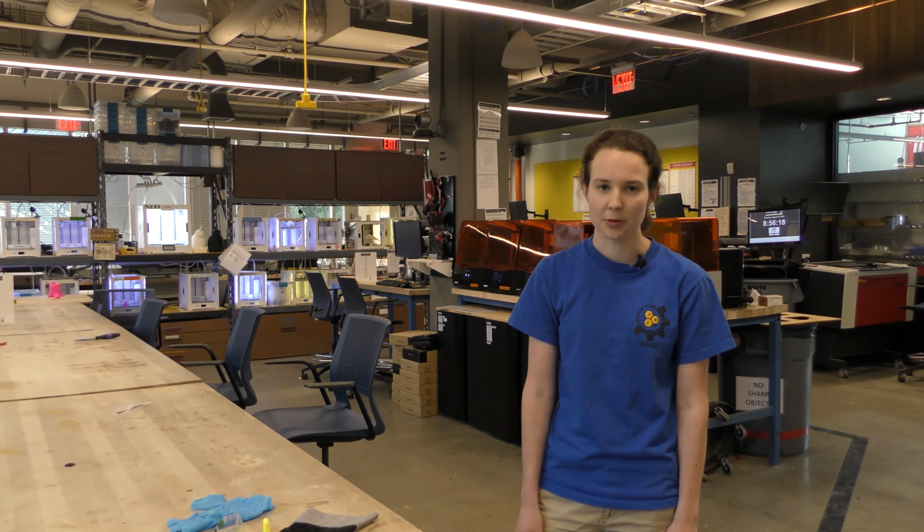My name is Claire, and in this video I'm going to talk about the safety section of the PI checklist. The first thing that it's important to know about when entering the Invention Studio is what PPE you need in each room. It's always a good idea to be wearing closed-toed shoes and to have your hair pulled back, and this is especially a requirement if you enter the wood room, the metal room, or the electronics section. You also want to make sure you're not wearing any jewelry, watches, headphones, or have loose clothing or hoodie strings that could get caught in equipment.